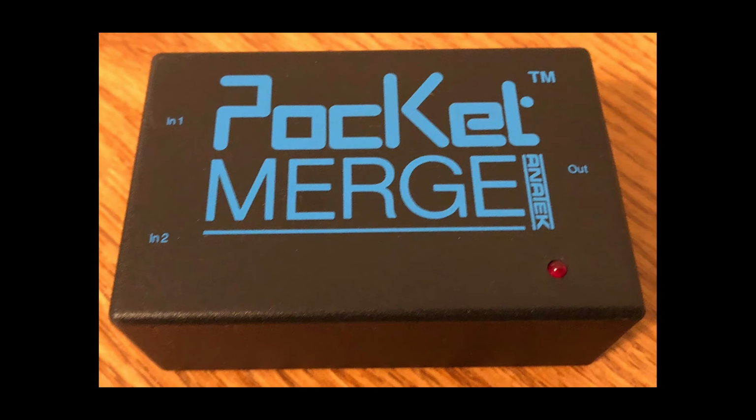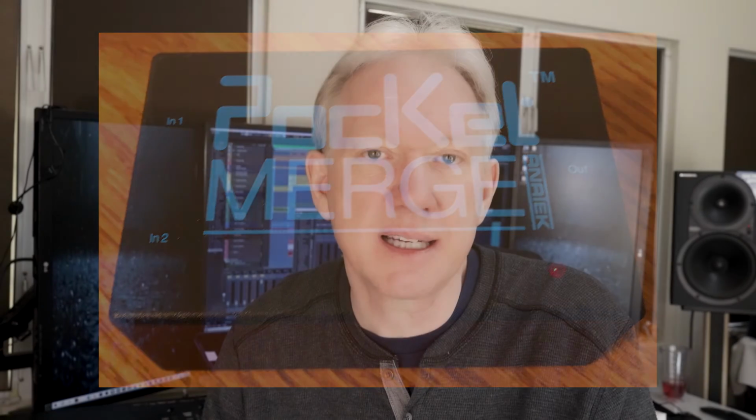Number 1, the Pocket Merge. This unit allows you to merge 2 MIDI inputs. For example, if you have two master controller keyboards, you would run the MIDI out of each keyboard into the two inputs on this device, and it would merge the data to the MIDI output port. From there, you could just daisy chain all your other MIDI devices.